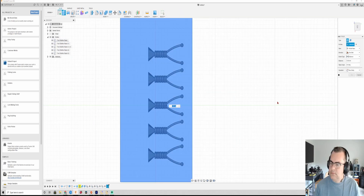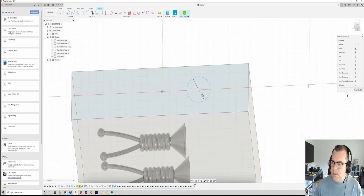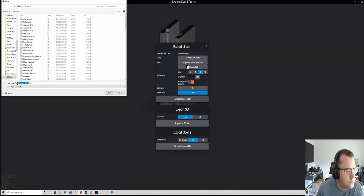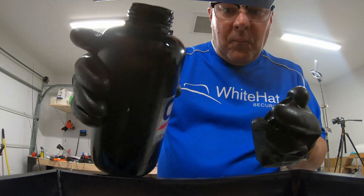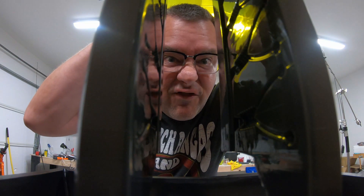Now let's talk about building the molds. The first thing I did was try to build one giant mold with all the cavities on one side. This seemed like a great idea until I popped it into my slicer and noticed it was going to take an incredibly long time to print. At this point, if you spot the incredibly stupid mistake I made, leave a comment below. Being an idiot, I decided to print it anyway. The problem with long prints when it comes to molds is not necessarily the time, but the amount of resin it takes and the number of refills needed. I gave it one final fill before I went to bed, which I thought was enough — it turned out to be not enough at all. I ended up with this wonderful mold that is missing basically the top quarter of it. That mold was a complete failure. I could have printed it again if I'd sat there and babysat it, but I didn't want to wait 19 hours, so a redesign was in order.